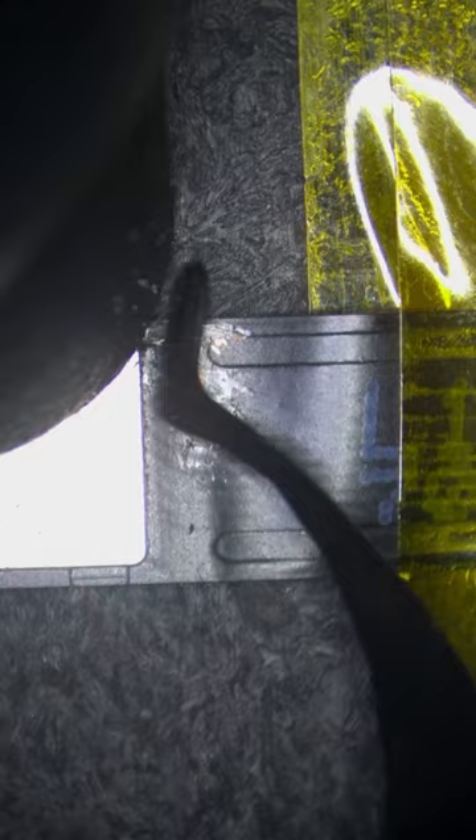For this next bit we'll have a look underneath our scope so we can start shaving away some of that coating on the flex cable, then we'll take a razor blade and cut it off. Then we're going to come in with a bit of solder and add it to the traces. We'll place a new cable underneath the old cable and run jumper wires connecting the old one to the new one.